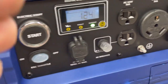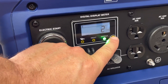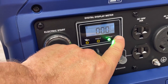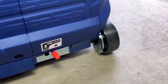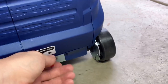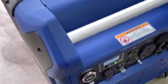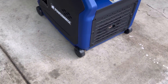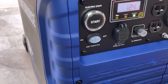We'll go over the features of the dash display. It shows your volts, amps, and watts, the amount of runtime as service hours, and also an estimated run time — so if you have maybe two gallons of gas with a 1500 watt load it might say you have four hours left. If you're familiar with the old generator or the popular red one, well this wheel lock is still kind of annoying. They really didn't change it much — it would have been nice to update because it just kind of rattles, and as you walk around the generator you can actually hear it the whole time — it's actually louder than the generator itself. You can find DIY videos to fix that wheel lock or make it quieter.